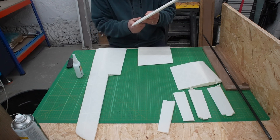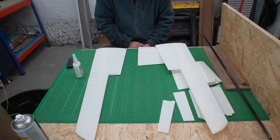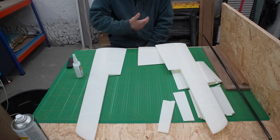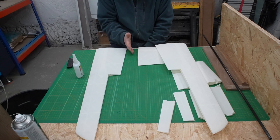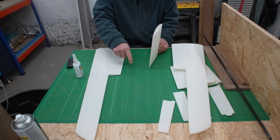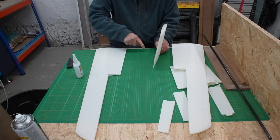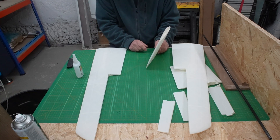One of the things about printing the parts is that the Eclipseon website is absolutely brilliant — it gives you loads of details and print profiles for your printer, in my case the Bambu Labs X1 Carbon. It gives you the print profile for how the print will be carried out. The method of printing is with a vase print or spiral vase, which means that rather than the print head going backwards and forwards between layers, it goes round in a circle — zigzagging in and out for the honeycomb construction.